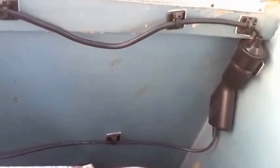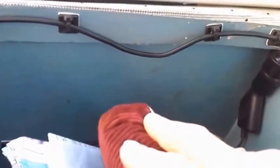I have a feed that's maintained through to a trailing socket, for want of a better expression, which takes a feed from the battery all the time, so that I can, if required, plug in a trickle charger at that point through the winter, when flying might not be possible, to maintain the battery charge. But so far, touch wood, I haven't had to use it.